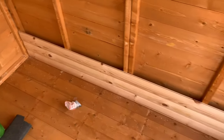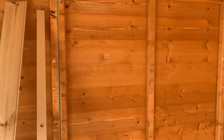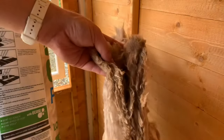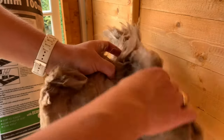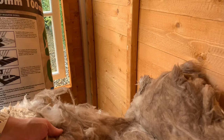Now that there are a few layers down and I've got an extra little brace prepped, I'm going to put the insulation in between. I can tuck them in the bottom and use this extra post to pin them roughly across the top just to hold it in place while I carry on boarding all the way up. The 100mm thick insulation is a bit too thick - it does split pretty perfectly in layers, so just work your way down splitting it in half and that's going to fill my 35mm gap.